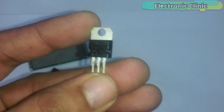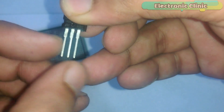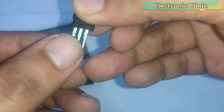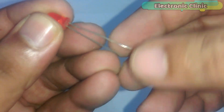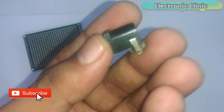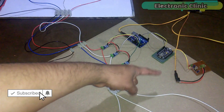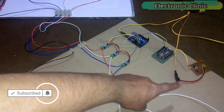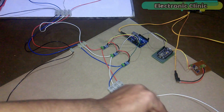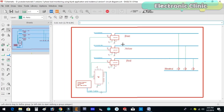Number six, 300-watt bulbs and holders; number seven, NodeMCU ESP8266 Wi-Fi module; number eight, 7805 voltage regulator — the left leg is the input, the middle one is the ground, and the right leg is the output; number nine, LED; number ten, 330-ohm resistor; and finally number eleven, DC female socket. These components can be purchased from Amazon — purchase links are given in the description.